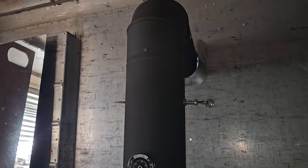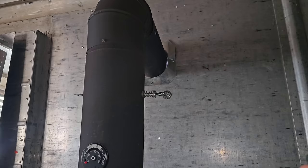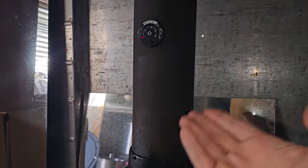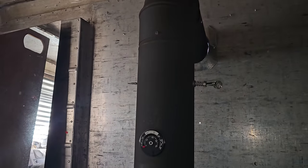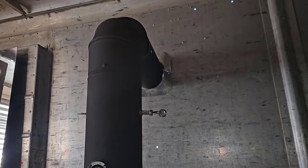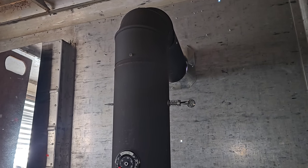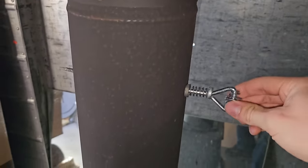The pipe is rusting because these are low-quality black Home Depot pipes. The pipes on the outside are galvanized so they'll last a bit longer, especially since they're not exposed to as extreme heat. These cheap single-wall Home Depot pipes — anyone using them to heat their house nonstop typically has to replace them every two to three years. Most people don't put single wall on the outside; you want double wall because single wall creates more creosote. If it's cold outside, it creates condensation inside the pipe, and smoke and debris build up as they pass through.